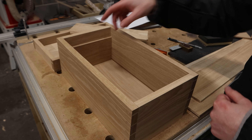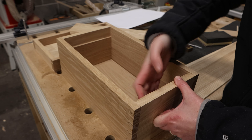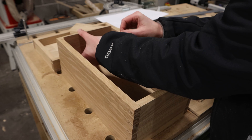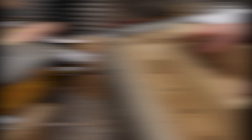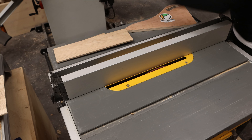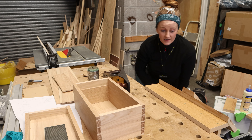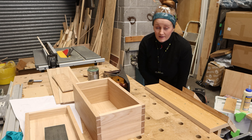I've got my two long pieces. I'm going to cut this down to the box size and then we can fine tune the fit with a hand plane if needed. I changed my mind and went for ash along the length and oak sides to contrast the outside of the box. I've got the pieces fitting nicely — there's no movement on the inside but they slide in and out quite nicely. There's not much wiggle room side to side, which is what we want, and then it drops straight in — which means I might be able to go for a piston fit, but we'll see.